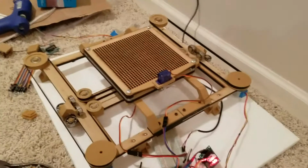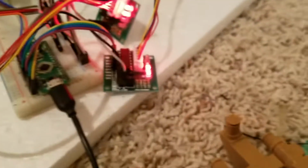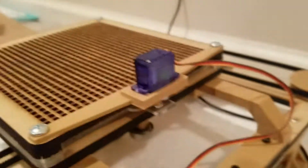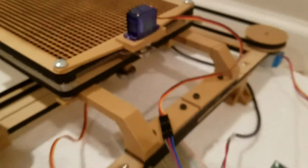And so what we can do is, well, let's go through the electronics real quick, actually. So we have an Arduino Nano, which is a $3 part, and then two air conditioner stepper motors with driver, and those cost $1 each. And so the electronics on here are actually only $5 at this point. Oh, and then of course two of the $1 servos from Tower Pro in order to both poke the pins up and reset the grid. Solenoids ended up being too big and required me to use more power than I can get from a USB port, so I ditched those.